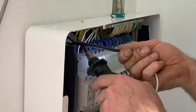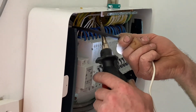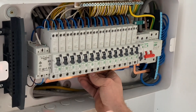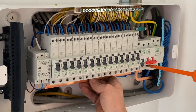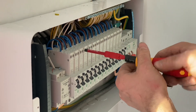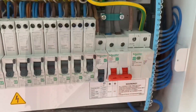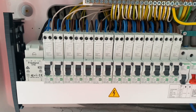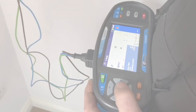Prior to testing — that's the finished board from RS Electrics. Adding some additional insulation to that alarm cable feeding out to the bell chime, because we've got two voltage bands within the consumer unit now. Putting the bus bar in, making sure everything is correct before the testing process. What comes next is obviously the torque settings of the devices — those are all marked on the shroud that goes over the bus bar at the bottom, which is good. Easy to find for anybody in the future. As we pan back at the finished EZ9 consumer unit, it looks considerably better than what we started with. It's also alleviated those problems — we've added an additional circuit, got a spare way, it's metallic, and we've got surge protection.